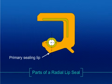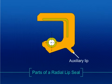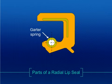The primary sealing lip is made of an elastomeric or thermoplastic material, which works statically and dynamically against the shaft. The cylindrical outer covering is made of sheet steel or elastomers. An auxiliary lip protects the primary sealing lip from contaminants. A garter spring provides additional force to help maintain lip contact with the shaft if required.